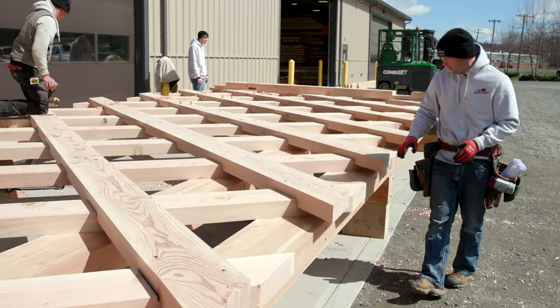Well, that was an exciting ride, but the bridge trusses made it to the site 1 mile down the road. So now we are going to pre-assemble this bridge off to the side, high and dry on these four concrete blocks. We're going to assemble the two trusses, the floor system, and the roof ties, and build this whole box right here on the ground. And in a couple days, we'll have a big 260-ton crane lift the whole unit as one big piece onto the abutments that we're standing on now.